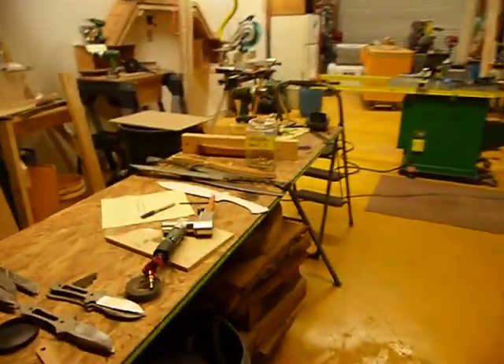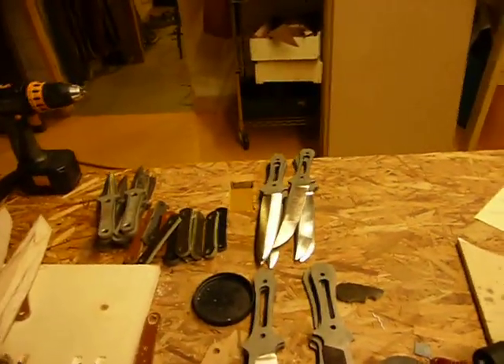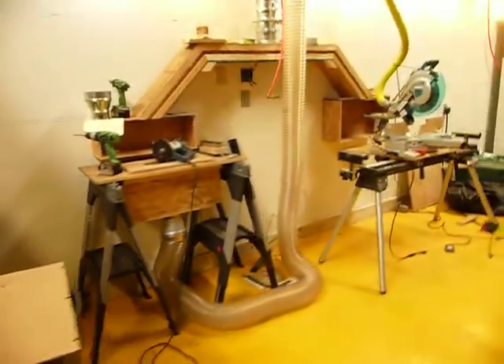The CNC router is down because the optical sensor screwed up — I ran it into the spindle. You can see some copper in there; it was sticking and ran all the way into the spindle and wore out. Hopefully I'll have that back up and running next week so I can make some more handles and new fixtures for handle production and keep moving forward.